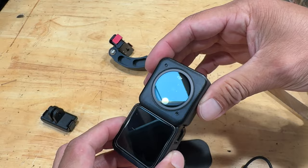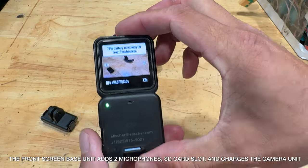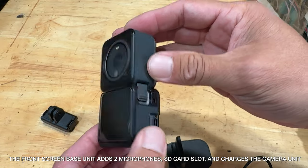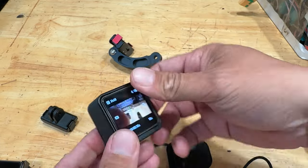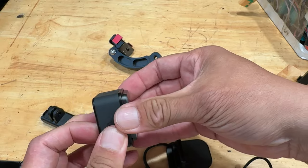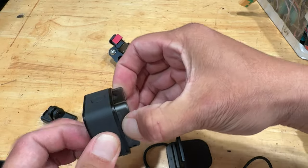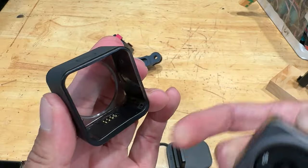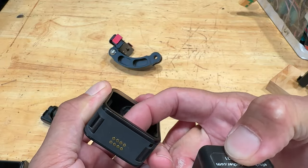This is the front-facing screen base unit. The camera itself has a small battery and only 22 gigs of storage, so the base unit can recharge the camera and you can offload footage from the camera onto an SD card on the base unit. I found that the protective rubber cover is not really waterproof — there are some electrical contacts that when wet caused my camera to crash when transferring files, so just be aware.